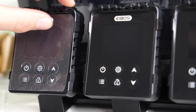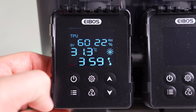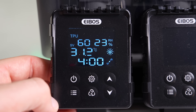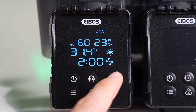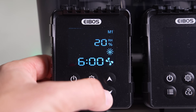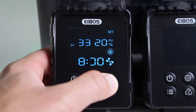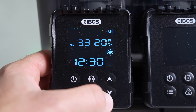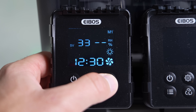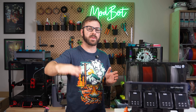Each of the heaters has its own screen where you'll interface with the heater for that lane and set your specific parameters. The power button is used to power on the lane, cycle to humidity mode, or power the lane off. Underneath is the option button which lets you cycle through PLA, ABS, PETG, TPU, and two custom temperature profiles. The settings gear lets you set drying temperature from 20 to 65 celsius, adjust drying time from 30 minutes to 24 hours, and choose drying power of low, medium, and high. You can also choose if you want drying to shut off when the timer runs out or kick into a humidity mode where it turns on until your set humidity target is reached.